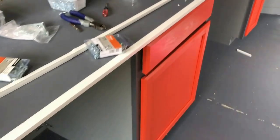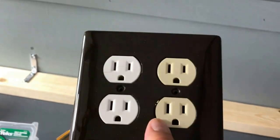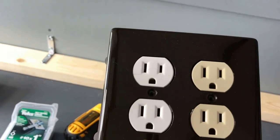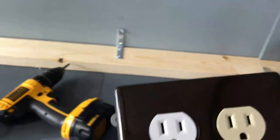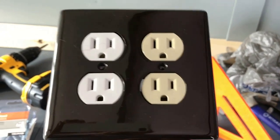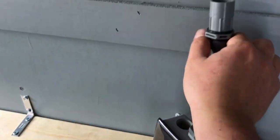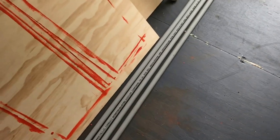I've got a little mock up here of what it's going to look like. I'm going to have two different circuits — 15 amps on each. So you've got battery charging, and if we put an air conditioner in here one day, fans — don't want to totally kill it. Most RC tracks you go to have the regular 15 amp outlet, so we'll just run with that. I've got this flex tube, and I'm thinking we'll probably run the pipe this way with regular conduit — probably a 90 degree bend somewhere.